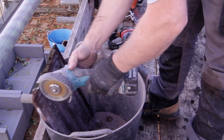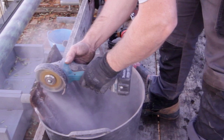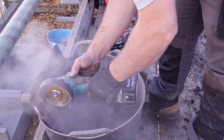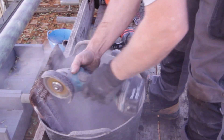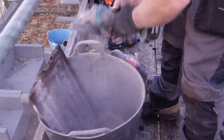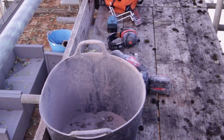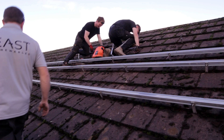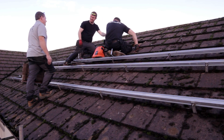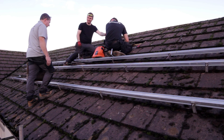Mike's going to demonstrate grinding out the back of one of these tiles — he's Team Makita with his power tools. The gorilla bucket catches the bulk of the dust kicked out through the grinding process. We're grinding little notches and then cutting those out to leave a flat space that sits over the hook put into the roof structure. What you want is for the hook to be sat above the tile underneath so there's a gap — when wind pushes down on your array, you don't want the hook to compress onto the tile underneath because it can crack it.